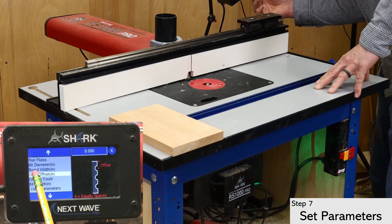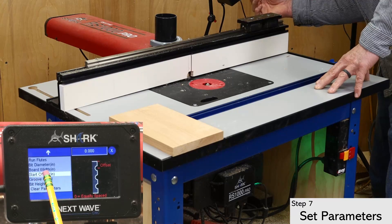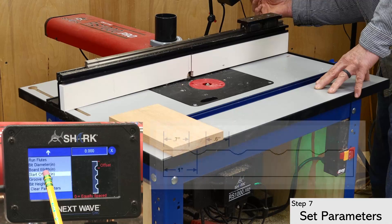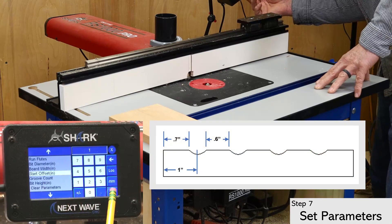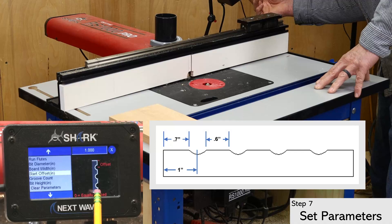Next up is the start offset. This is the measurement from the edge of the board to the center of the closest flute, as you can see in the diagram. If you leave the setting at zero, the spacing between the flutes and the spacing at the sides of the boards will all come out the same. I wish the offset was to the edge of the flute rather than to the center, because if you enter a custom size, the app doesn't tell you how wide the outer space will end up. So for this app, I did a scale drawing to help me determine the setting. It shows that a one inch offset will give me the results I want. I also ran a practice board to verify the results. A scale drawing and a practice piece are a good choice before running your final material.